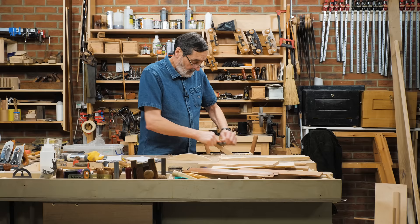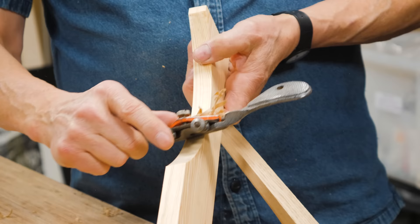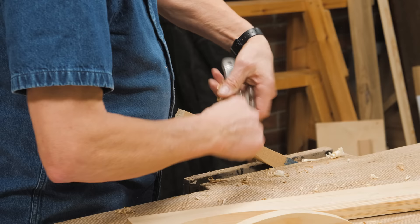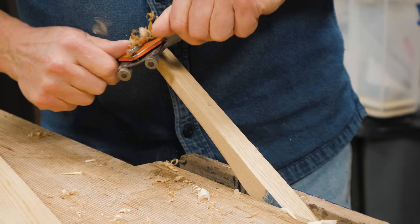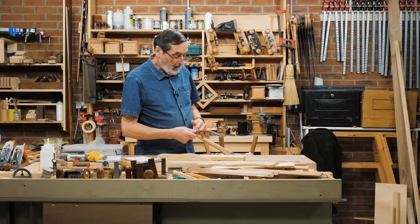It's totally adjustable — slacken this screw a half turn and touch this. When doing the inside of a curve, you want the blade to protrude equally across the length. But when working on a corner, you can set one side of the spokeshave deep to hog off lots of wood, then move over to the finer setting side. You can walk around the work — this is the most versatile tool.